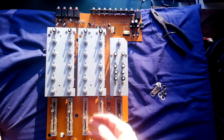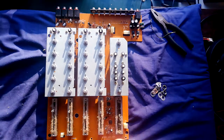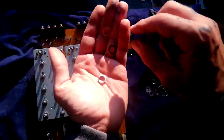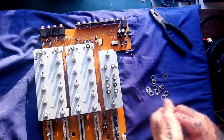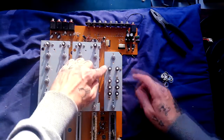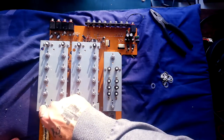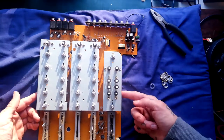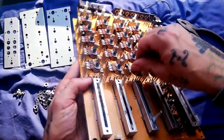Now with a bit of rare Scottish sunlight catching the accumulated filth, we can see the parts that came off these quarter-inch jacks: three parts each — a nut, a metal washer, and an indented plastic fitting that sits in the socket on the rear panel. We are not out of the woods yet — there are twenty-two washers to remove before we can properly access these for cleaning. Finally, we've got enough access to these potentiometers to clean them.